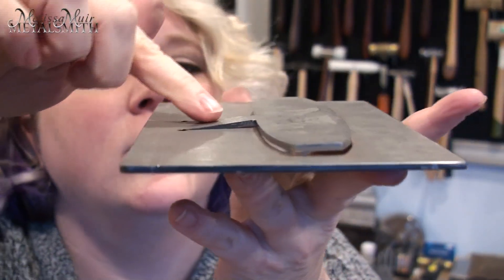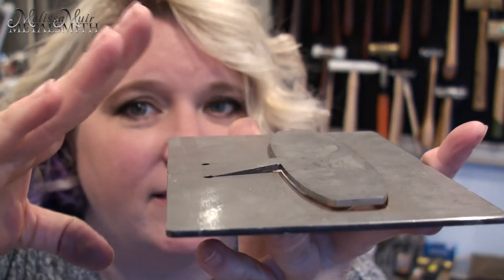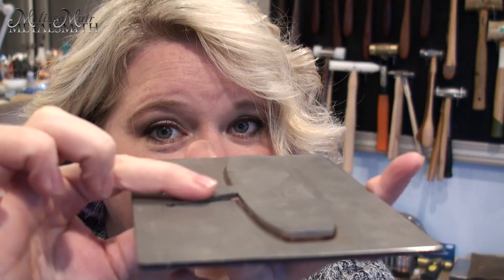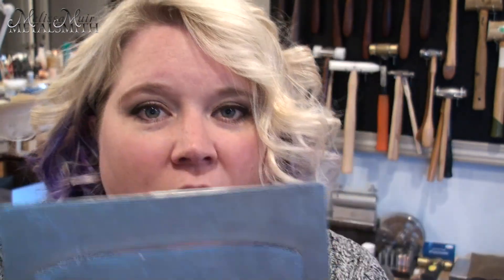What has happened is that before, my die would come up at an angle and stay that way. Now what's happened is it's come up and then flattened down as well. So I have changed a little bit of my die by putting some pressure on it. But even though the car was heavy, it was not enough pressure — you really have to have that solid, direct pressure coming down on it. It was not enough to cut through the metal. Running this over even with a nice heavy car is not going to give you the kind of result that you would really want.